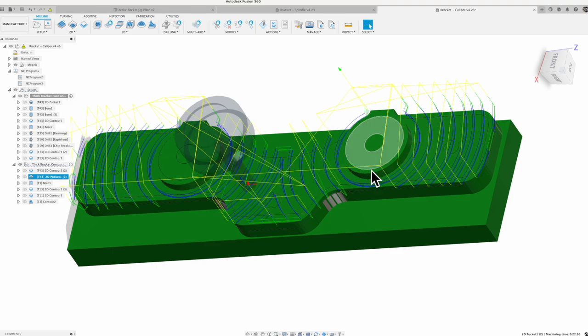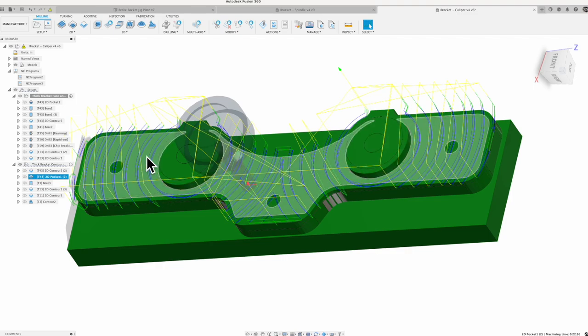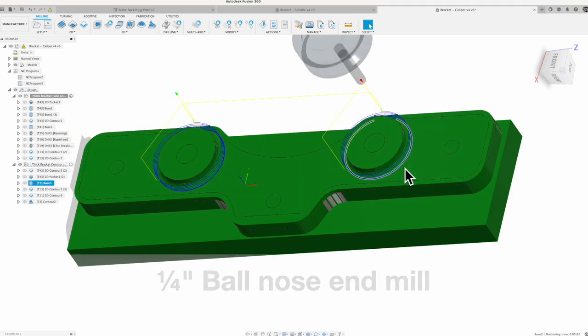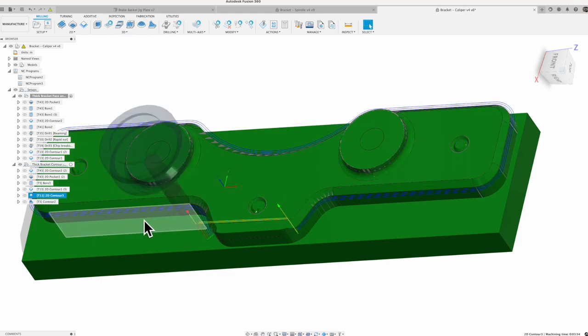This is the design change, a little bit different than that 3D printed plastic one. We've got these bosses sticking up to give a little bit of clearance on that caliper where these bolt into place and then leave some room around that caliper to sit. After that, I'm going to go in with a 1/4 inch end mill to give that big radius that we need on these. Just do a couple of quick chamfers around the top of the bosses, around those holes. Going to do a heavy chamfer around the outside. This one is a 1/4 inch chamfer.